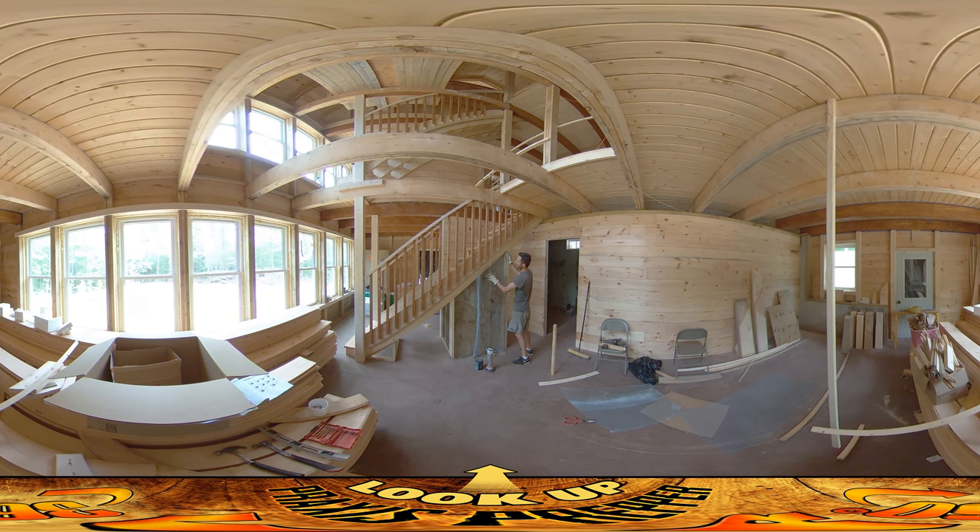I've got it a little bit high so I'm going to fold it and tuck it up on the inside, and this side is going to get folded over and attached on there. The wire lath will give the concrete something to grab onto when I'm putting the stones in, and I'm going to attach the wire lath with some screws and washers right into the studs back there.